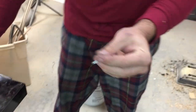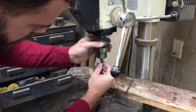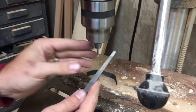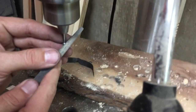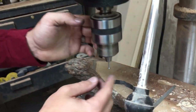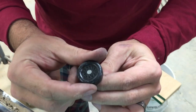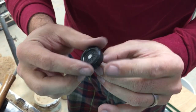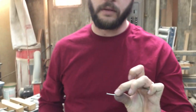Now, doing all of that, I've taken the outside of the head and it's probably no longer perfectly round. So I want to take that back over to my drill press, chuck it up — I only hand tighten these because I don't want to damage the nails — and go back to my fine file, just ever so slightly right at the edge of the head. I want to take just a little material off. I really watch more of the filings coming off than the head itself. Then I want to test fit it, put that nail in, and see how much of a gap I have — making sure the edge of that head is not rubbing anywhere on the inside of the wheel. And that looks pretty good. The next thing I want to talk about is how to cant or bend the axles, and we'll cover that in the next video.